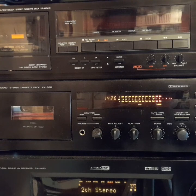Another problem you might run across is a recorder running fast or slow. Unless the speed error is extreme, you won't notice it, unless you have perfect pitch, and small errors are not very important. If you can hear problems, a visit to a service center is the only cure, although it could be a faulty cassette.